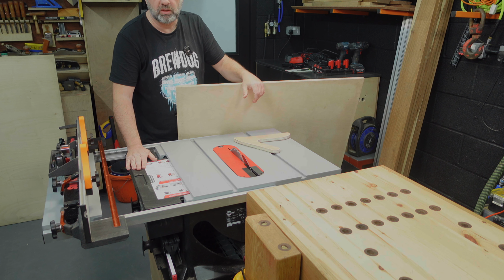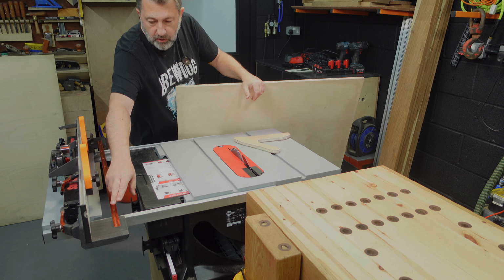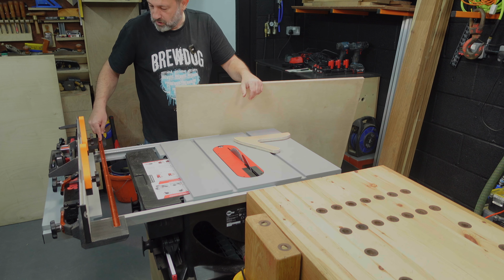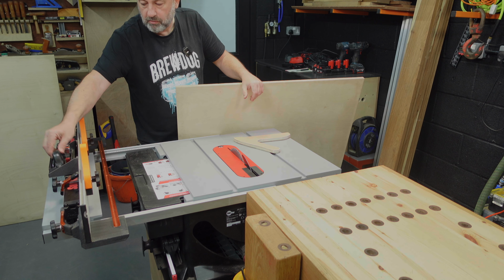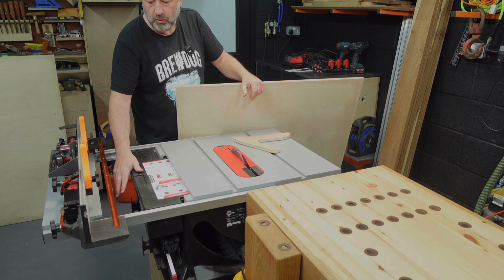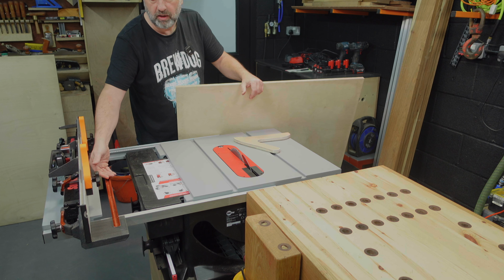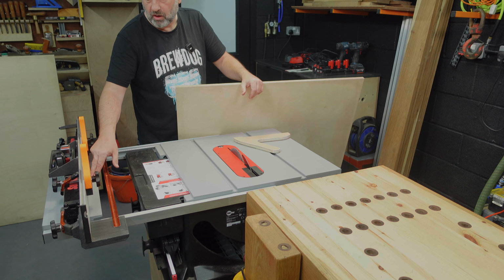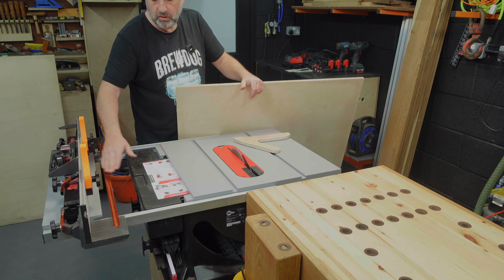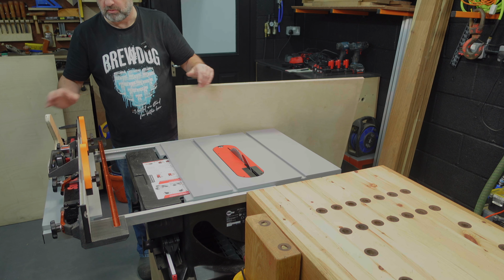So for those of you who haven't seen a video about 3 videos ago, I made this fence similar to the bow fence system, but with this extra add-on and a few other extras like the calculator tray and the tool tray, like for your measuring tape or your digital angle finder. But this gives you support on a job site saw, which you lose if you have an auxiliary fence, because you can't use the inbuilt fence's support here. In this instance, I've got support here, so it wouldn't be too bad. But if you were just cutting a piece a little bit shorter, you'd have no support there. So that's what that's about. Go and check out that video. I'll put a link in the description for that if you want.